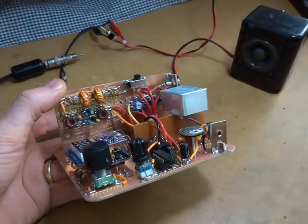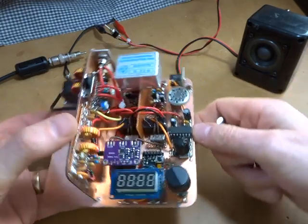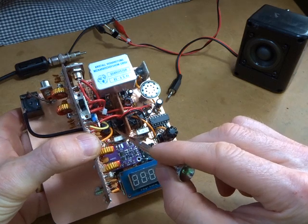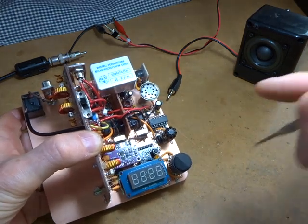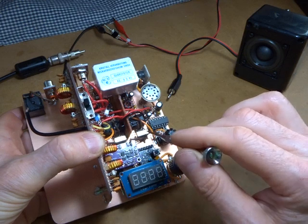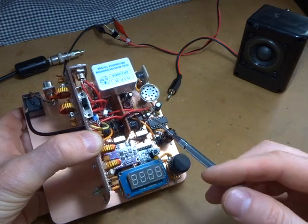Through the bandpass filter into the antenna amplifier. Out of the antenna amplifier then into one of two relays that, as we saw in a couple of videos back, are providing that switching network — basically turning the mixers into either product detectors and mixers or balance modulators and mixers and vice versa. If you go back a couple of videos you'll see that.